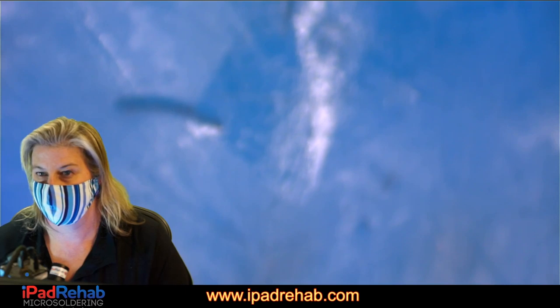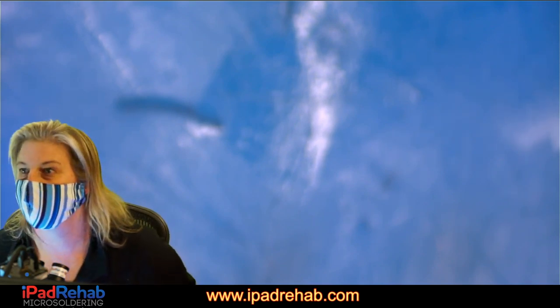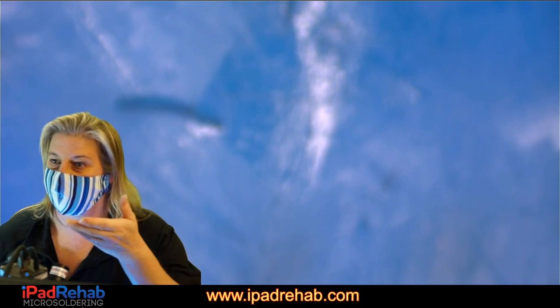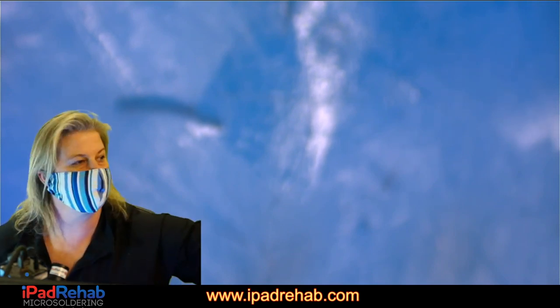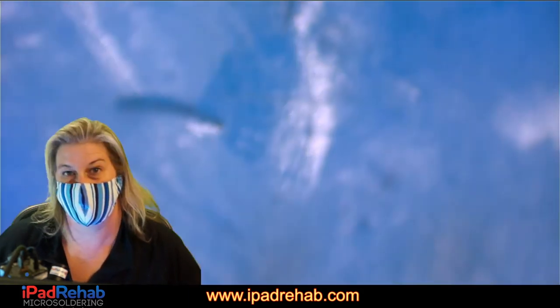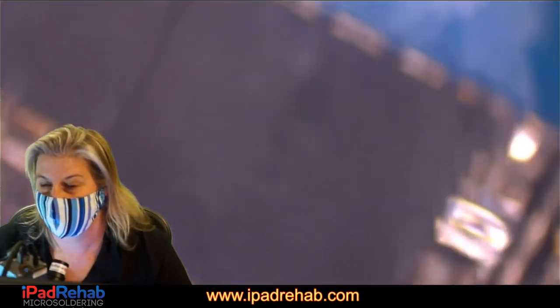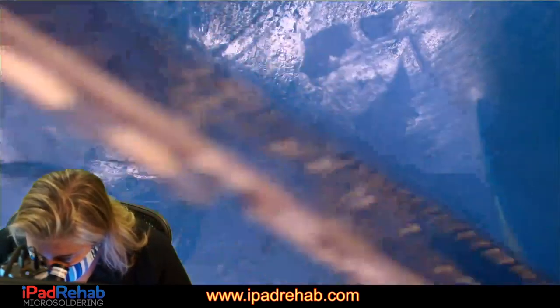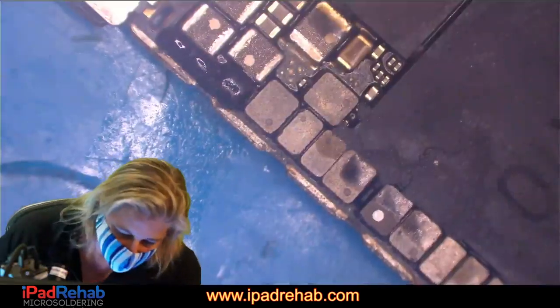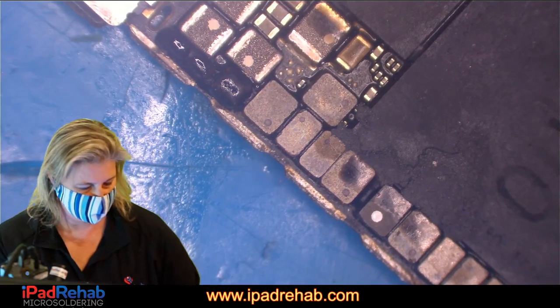Oh, by the way, it's so funny that the two phones that are here that are botched CPU jobs are from the same people, like Rico, for example. He's the guy that did those two. That's pretty funny. And now they're here, and now we can't do anything with them because we don't know what the original problem was and whether or not that's even the same CPU. So that really stinks. All right, so let's see if heat shows us something different now that we've taken that shield off. So we'll try that strategy again.